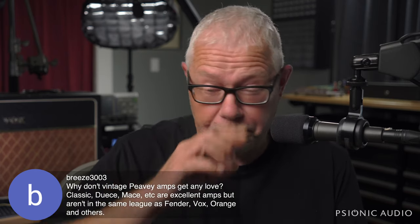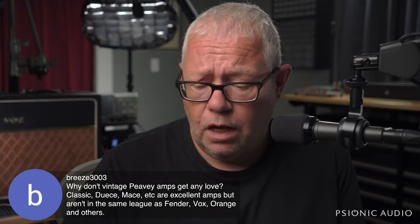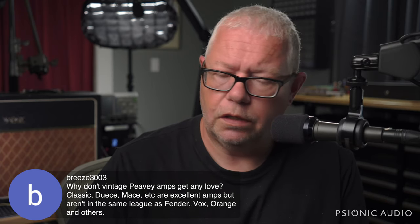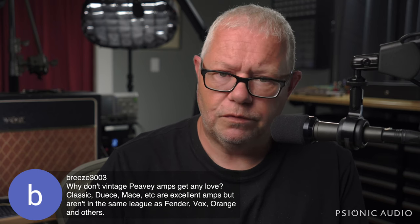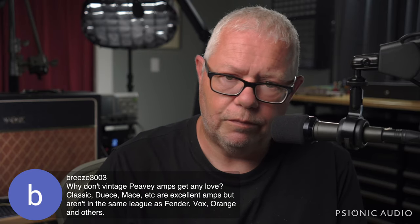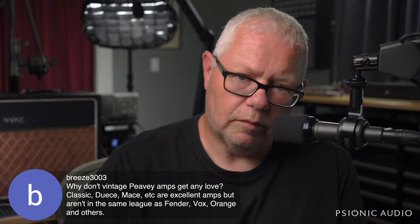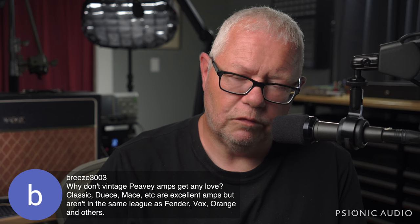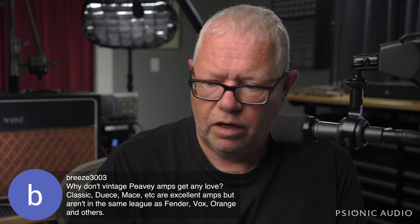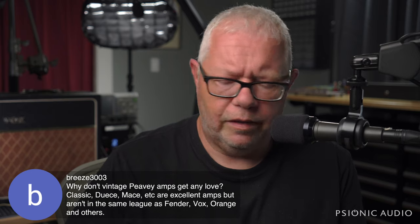Now, 70s Fenders, the two things you need to look at, three things. About 72, they switched from having a screwed-on baffle with cleats to a glued-in dadoed baffle. Those baffles, if something goes wrong, it's harder to replace. You got to cut it out, flush cut it to the cab, put in cleats, and put in the old-style baffle. About 73, they started heavily wax coating the boards. That wax needs to be removed in a lot of cases because it traps contaminants over the decades and becomes conductive itself.